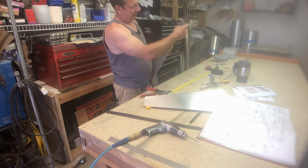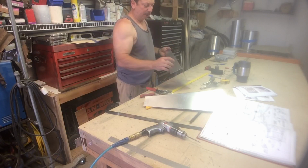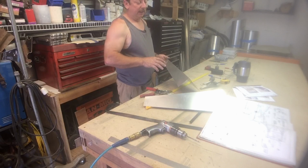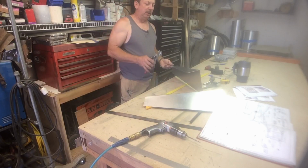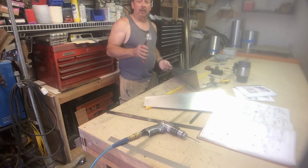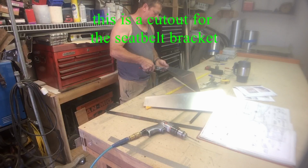And this attaches to the fuselage structure. So I'm going to go ahead and mount L angle to the places that it goes on here. I may rivet them in place, but I'll at least cleco them in place so we know where they go and everything's in position. But I'm not going to drill them into the fuselage until I actually get the flaperon rods mounted in there and make sure we've got clearance for everything.